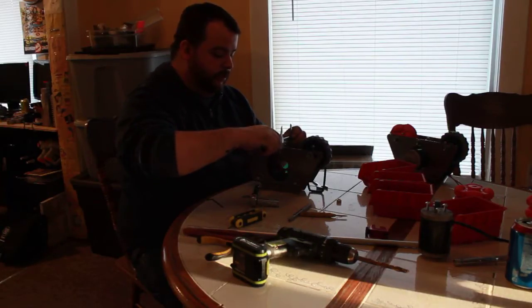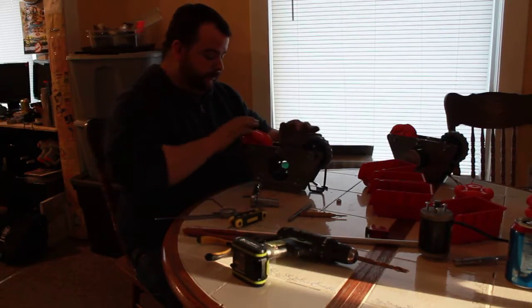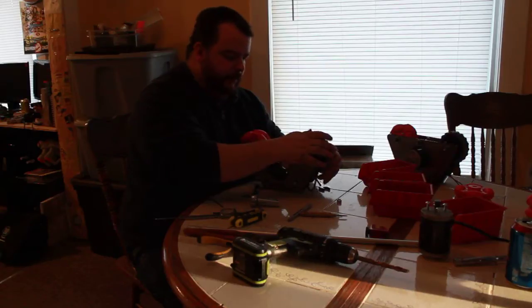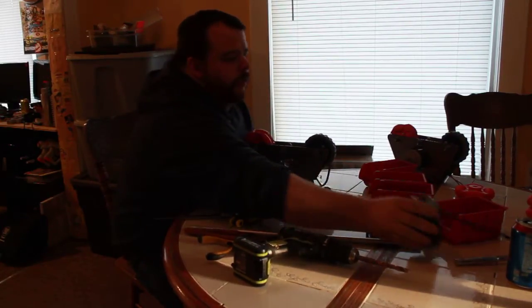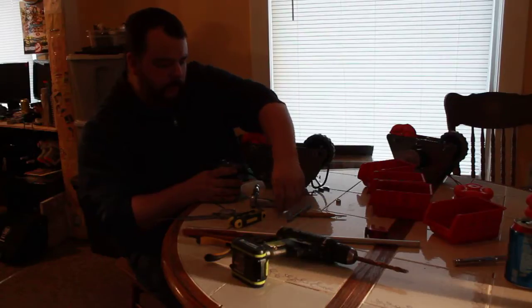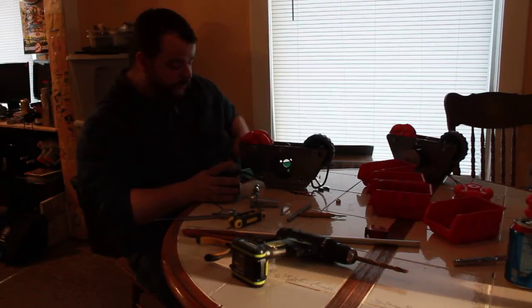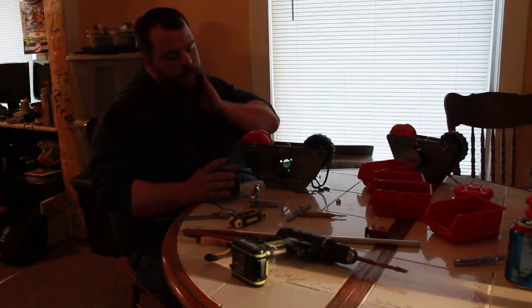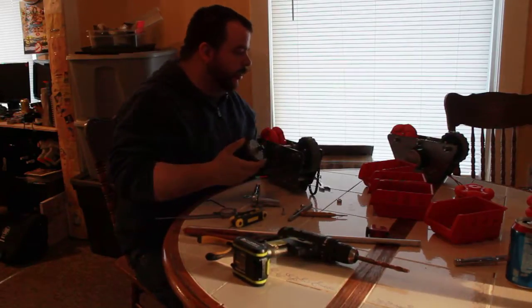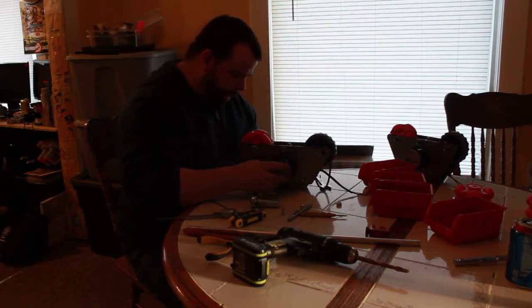So we're going to measure this to make sure that we're at the right distance. We're sitting at 2.5. Don't like that, but I can't do anything about it. So let's slide our chain on. We're going to install the motor too, which is right here. These are M5 screws for this motor on the scooters. Mine are 16 millimeter long and they seem to fit just fine inside. You can use cap head or pan head. Either one works, at least I've seen. I think I ran it this way. I did. And it just slides right in, no problems.